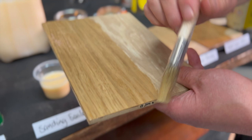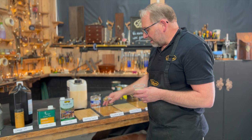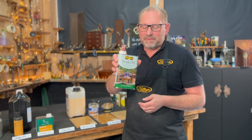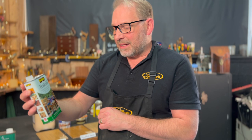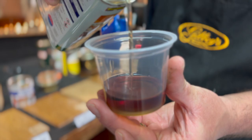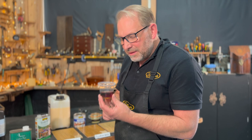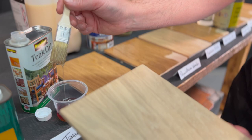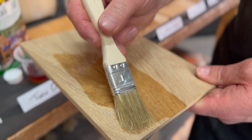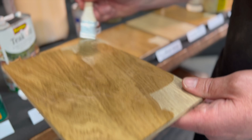I expect that sanding sealer will dry in about 15 minutes at this temperature. Teak oil is the next one — for interior and exterior use. It's described as the original oil that enhances the natural beauty of all woods and veneers, leaving an attractive low-gloss finish. It doesn't have a very pleasant smell — it smells almost petrochemical, really — and it's very, very thin and oily. I'll leave that 10 to 15 minutes and wipe off the excess.